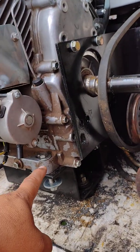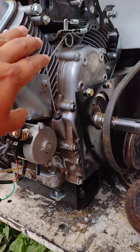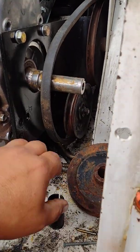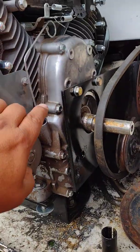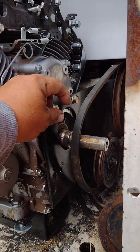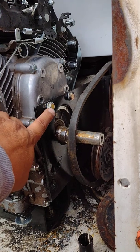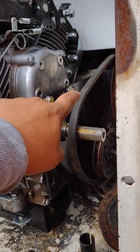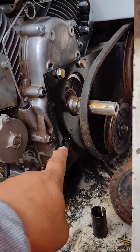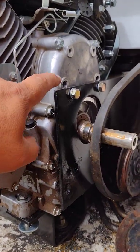Being that it lines up naturally here and naturally here, it feels like this is meant to be. After removing the motor I made a cardboard template, cut a hole and slid the cardboard onto the motor. I had to stab it with a pin to find the right hole, then ran the bolt through and screwed the cardboard onto the engine. To find where the other holes were I used the pin stabbing method. I didn't use all four — I used one, two, the bottom one three, and four. I only used the outside three.